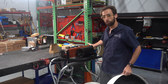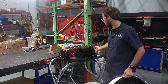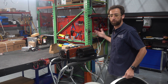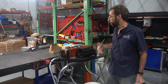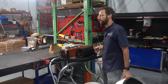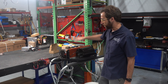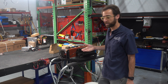On the back end we have two hoses — water in and water out. The condensation can either drain straight onto the top of the boat and off the side, or we have a small pipe stub you can connect a hose to for a separate dedicated drain. We've retained the copper fin evaporators, once again for that added longevity.